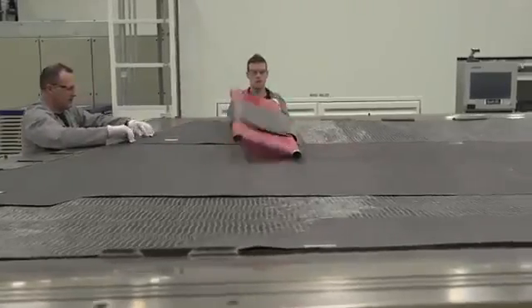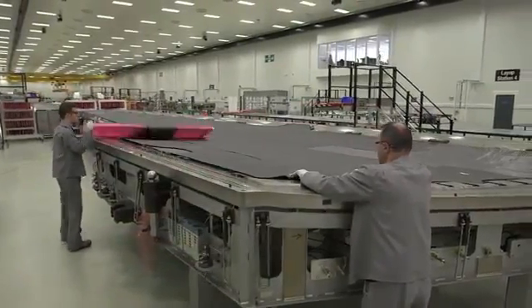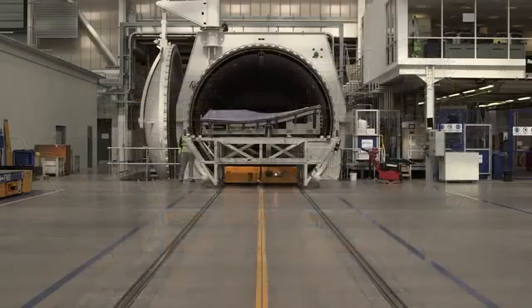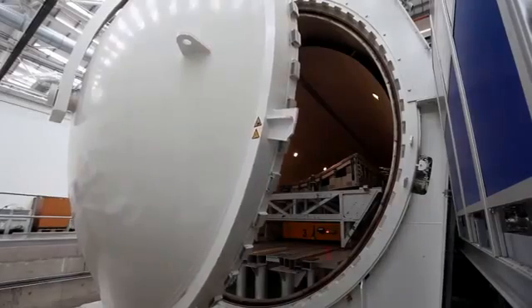The parts still have to be married up to a spar, which we make ourselves — but it's a beautiful spar, it's one piece. Once you understand the strength of this composite finished part, it's awesome. You're having a lighter wing; aerodynamically it's very good, it's more slippery because there's no rivet heads, no fixings — the air flows over it smoothly. It's a win-win.